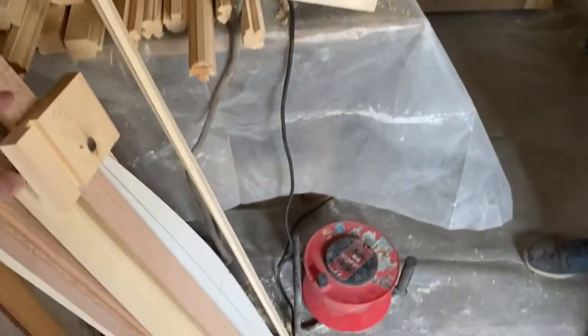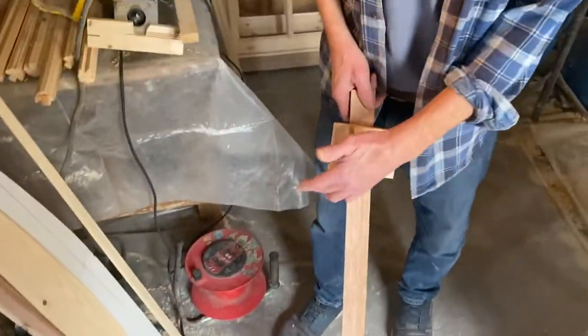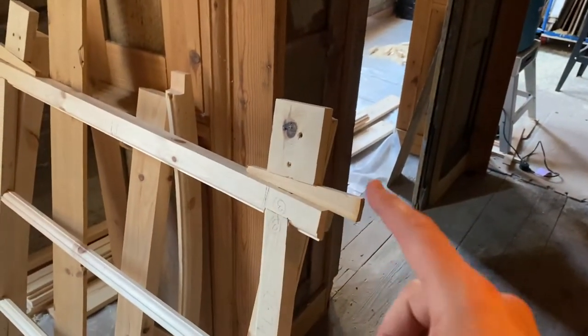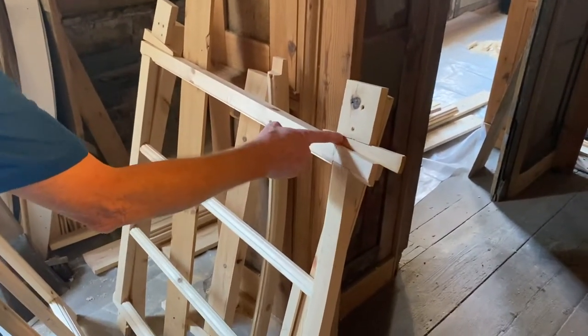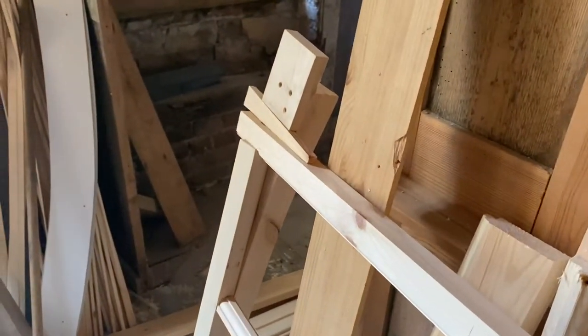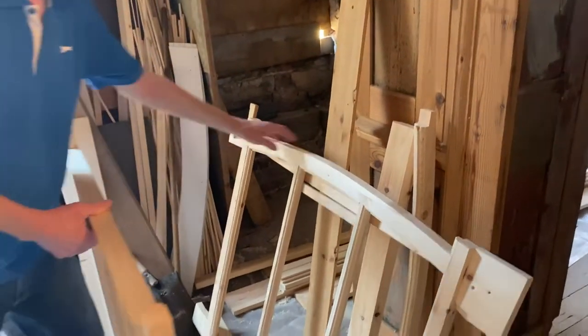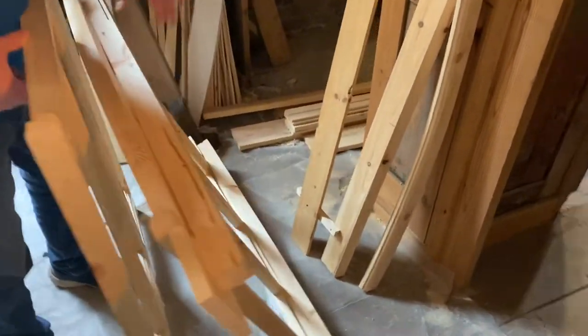And then the sash also involves a clamp. Basically, it just works with a wedge to clamp things up. You just knock it in and it squashes everything up. It'd be a lot easier with a four-foot G cramp or a sash cramp, but this is proper old school. At what point do you need the clamp? Once I put the glue on it, but I put that on dry just to squeeze it up.